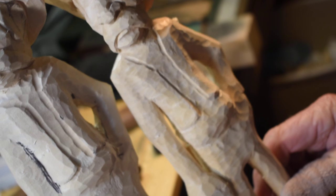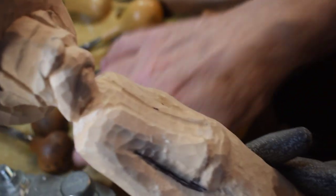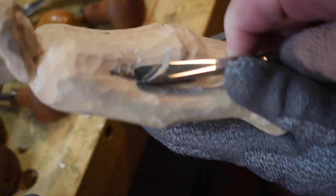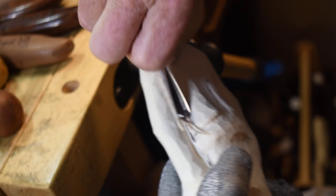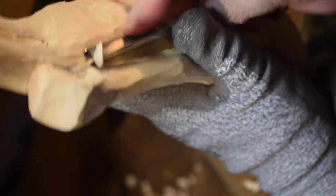It probably needs to be opened up just a little bit more, but while I'm in here I'm going to start removing wood right up in here. I'm going to take a large V tool and come in and start working this way, and then here in the back. When you're doing this, you want to take more away from the inner body and not the arm — if you take too much off the arm it's going to look funny.